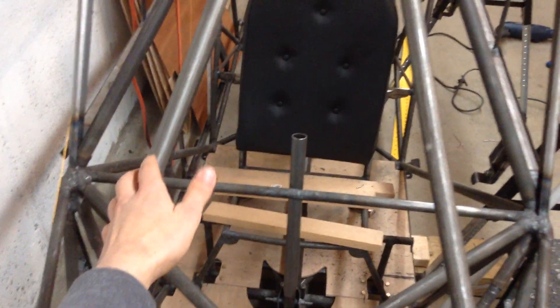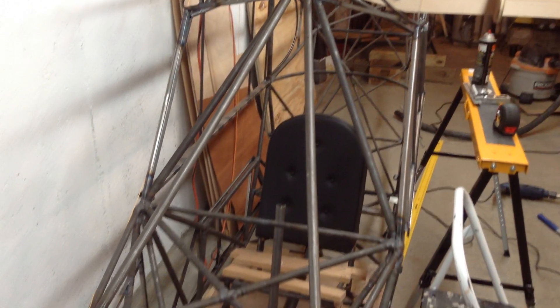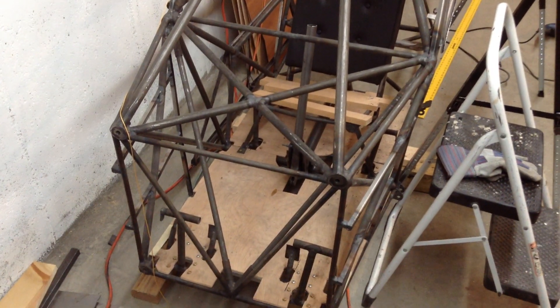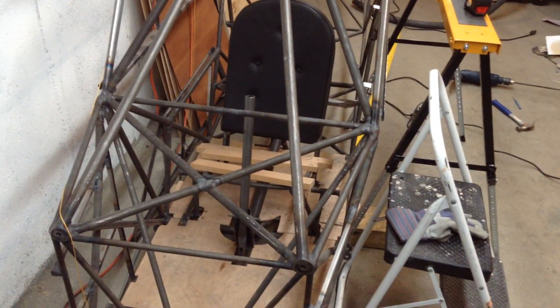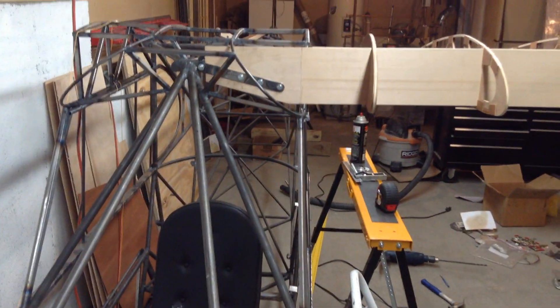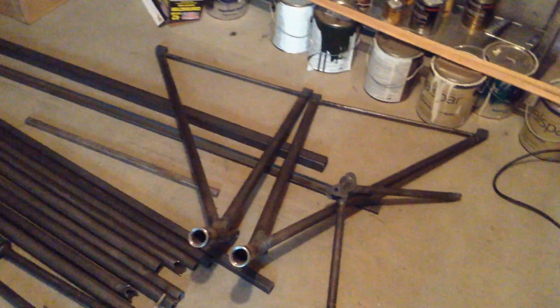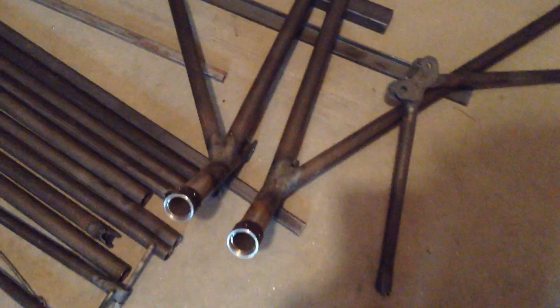Normally these two tubes here aren't on an original J3 — that's per the plans for the bigger engine, the 150 horse O320, a little beef-up. Same goes for the X bracing, and some inserts added in the tail area. Got some more steel in here. My landing gear — hand fabricated except for the weldable axles, which I've had to form the ends on.